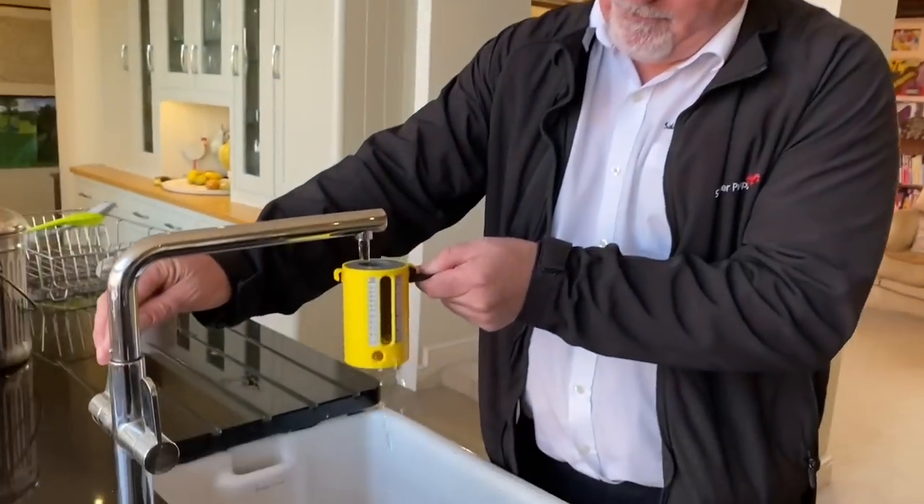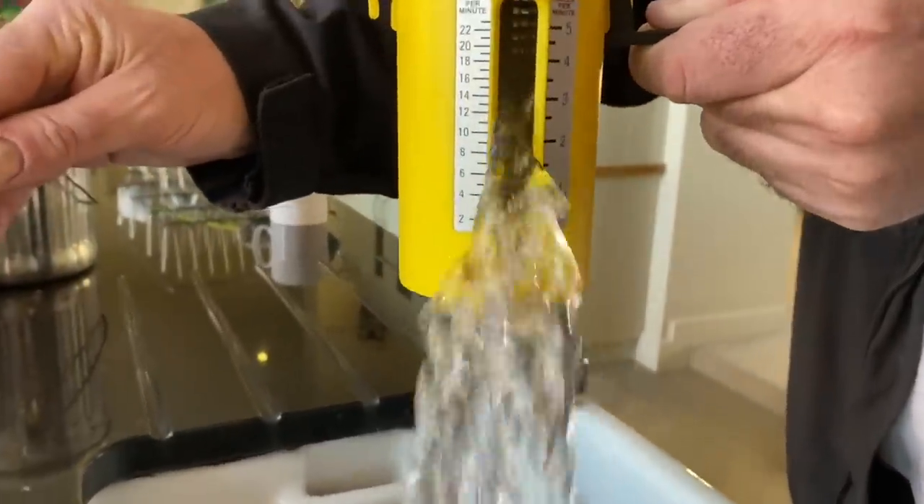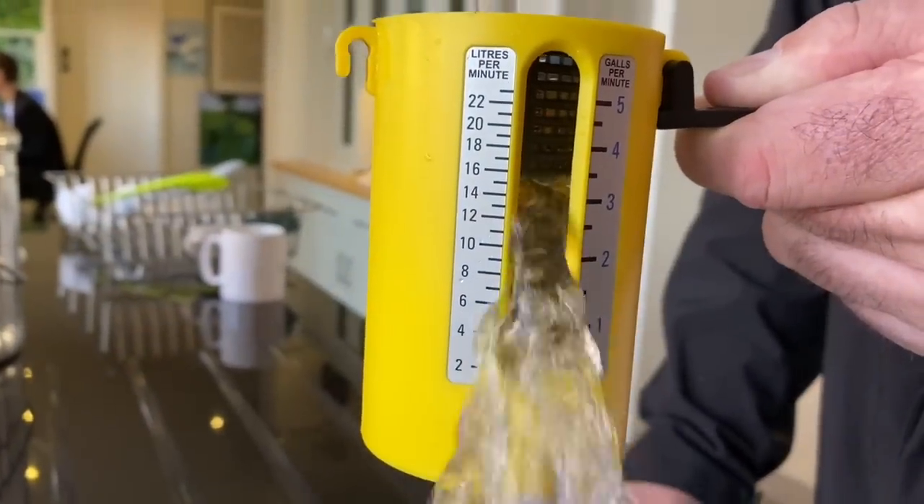I'll add a link below to the full video we did on this one. These taps do have restrictors in, but as you can see we've got about 15 or 16 liters a minute at this tap now. The difference on that system was just night and day - it went from one tap working at seven or eight liters a minute, and if you turned another tap on one of them stopped, or if you had the shower on and the washer started to work the shower just went off. It went from that to being able to have three or four showers on at the same time with an okay flow - an amazing, amazing difference.